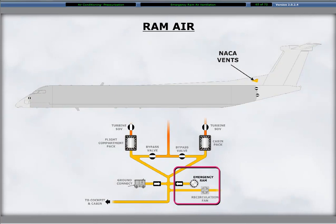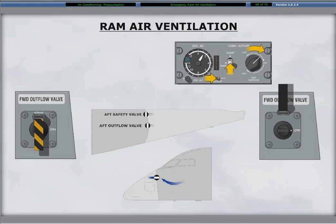When the aircraft is in flight and not pressurized, outside ram air ventilates the cabin and flight compartment. Ram air enters through NACA vents in the dorsal fin, passes a check valve, and enters the supply ducts downstream from the air conditioning pack to the cabin and flight compartment. Ram air ventilation requires the manual selection of the auto-manual dump switch and holding the manual differential switch to increase for 50 seconds. Then the forward safety valve must be opened by turning the forward outflow knob fully clockwise or turning the forward safety valve selector to the open position. This action fully closes the aft outflow valve and opens the forward safety valve and outflow valve, allowing the air to exhaust through it.